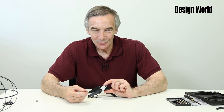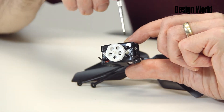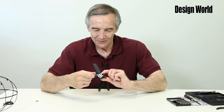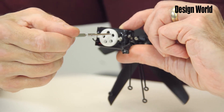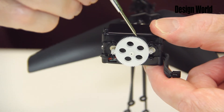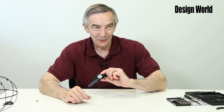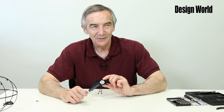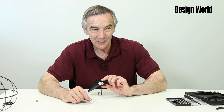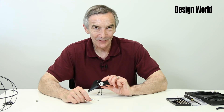The way you achieve counter-rotation on a budget is to use two different electric motors. You can see at the bottom there are two drive shafts, each driving a different gear — one for the top prop and one for the middle prop. On a real helicopter with two motors you'd have to synchronize them, but the builders are depending on the fact that the manufacturing parameters of both motors are probably close enough, and they're both running from the same battery pack, so they spin at approximately the same speed to make the whole thing work.